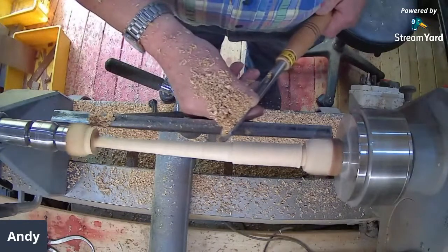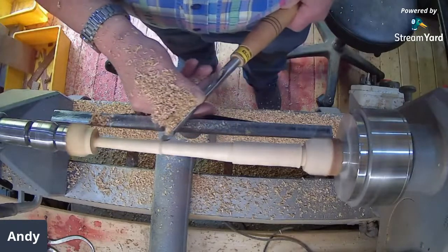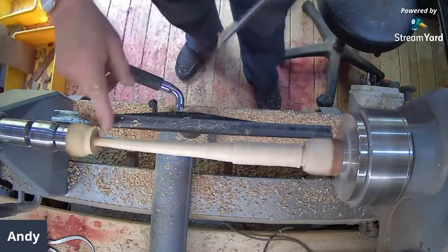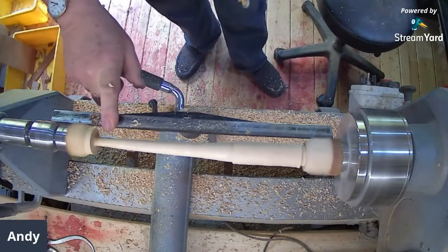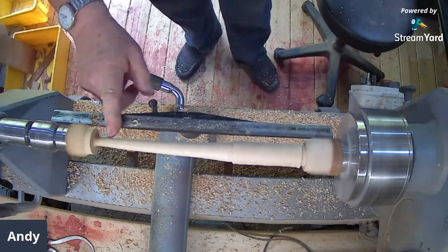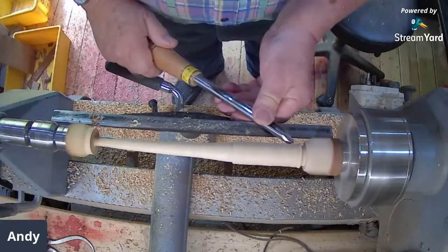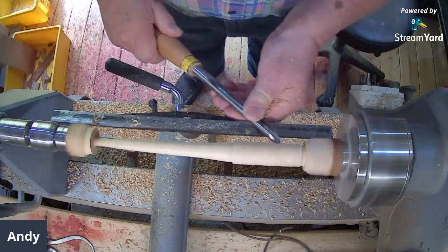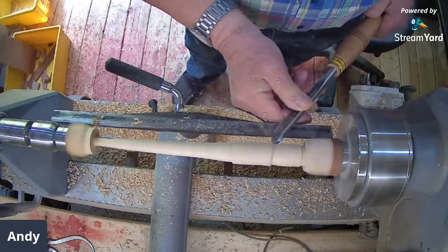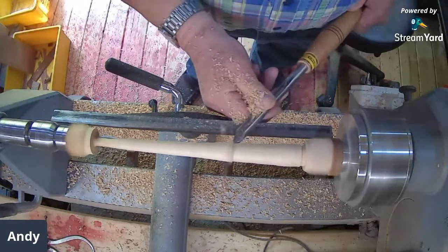It's really quite pleasant when you've just sharpened your tools — it certainly makes a difference. I should take this down to about 6 or 8mm at the end, but I won't make it shaped for the first 15mm, just to leave a bit of strength there, because that's where it will fall apart given half a chance. The handle itself wants to be shaped a little bit more, but very little. You can almost finish that to a sand now.